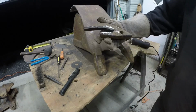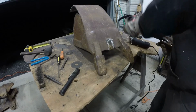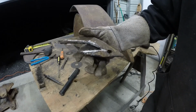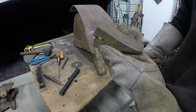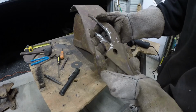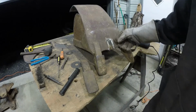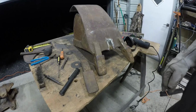So that's what the tooth looks like. And then there are 2 pins that go on the bucket like you've seen. And then there's a pin that has a replaceable tooth here that you slip in there, slide a pin through, and then when you replace it, pull the pin out, bang, you got a new tooth. So I'll grind this up and then cut the whole bucket.